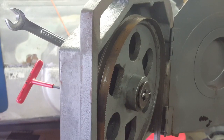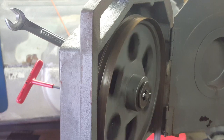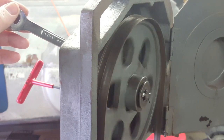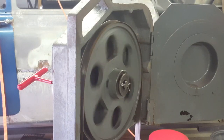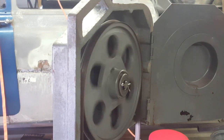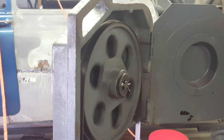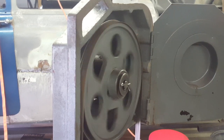Let me get you close. If you'll notice, see how that blade is just about to come off of that top pulley — it's running, barely on there. I've got the Allen wrench there and my 12 millimeter wrench up here. I'm going to loosen the adjusting bolt and screw in on the set screw to change the angle of that top pulley. All right, you can see that's running pretty good now. The top of the blade is hitting the back of the pulley — that's good. And down here at the bottom, it's almost hitting the back of the pulley too. I think that's perfect — that's going to work good right there. That's a pretty good setting.